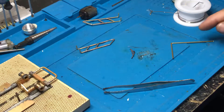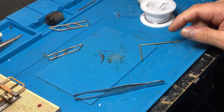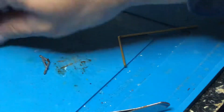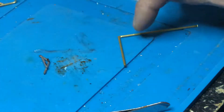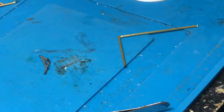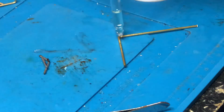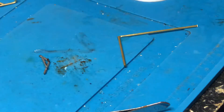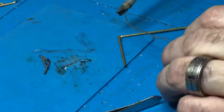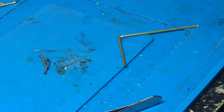So here's something I'll show you if you want to do these. This is solid tube right here and this is a hollowed tube. I'll do hollowed tube first. Say you want to do a ninety like that, so we'll put a little flux. You can also use the honeycomb board to hold them in place if you want. I'll just clean my tip here — it's a little dirty.